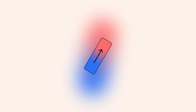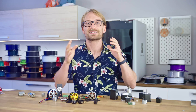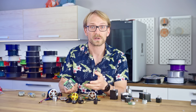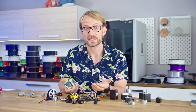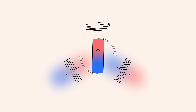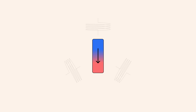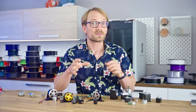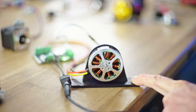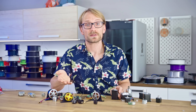We want that thing to spin — that's the whole point. Whether it's two coils or three or eleven doesn't really matter when you have a modern controller that runs a variant of FOC, Field-Oriented Control, where instead of going through a fixed step sequence or current tables, it continuously does the math for how it needs to align and combine the field from the electromagnets relative to the magnet in the rotor so that you get the torque or positional output you want. I've been using SimpleFOC to run these BLDCs, and it can just as easily run a stepper motor if you give it four outputs instead of three. To the FOC algorithm, these are all the same.